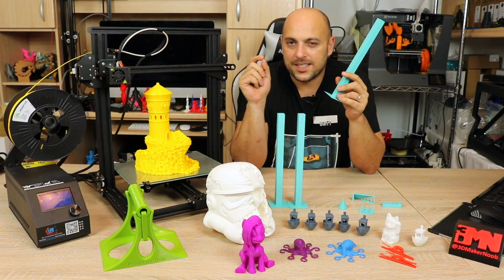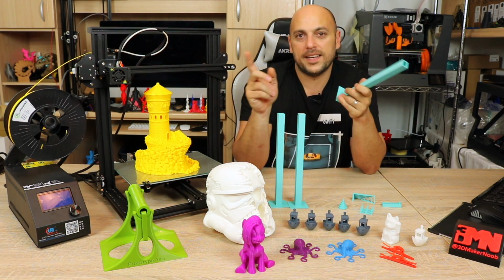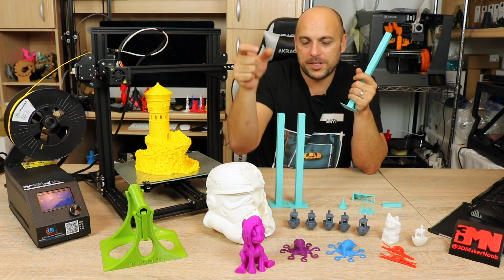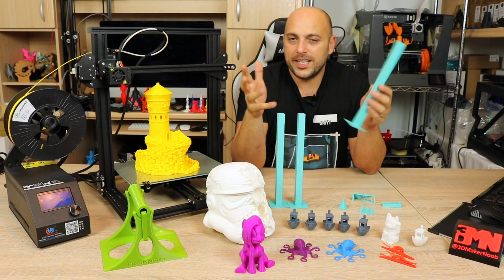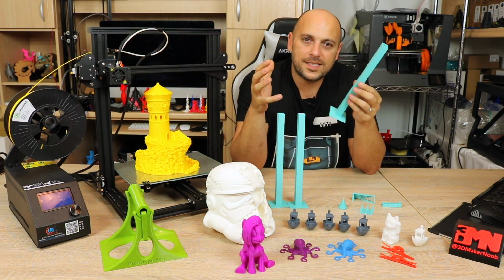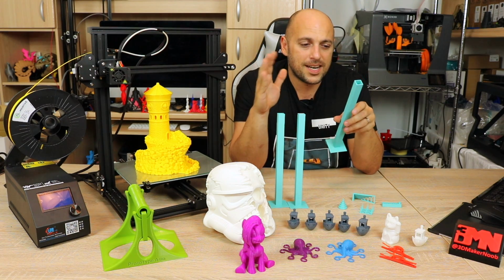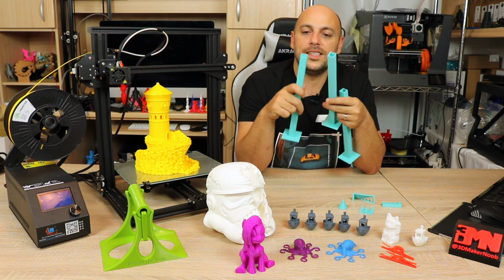It could be the eccentric nuts need to be adjusted, or it could be the fact that now the Z-axis lead screw is kind of held in place, so it might have a role in that. But the Tornado is also the same way. It's still eccentric nuts, it's still a single lead screw, and it is 400 millimeters high. But it printed quite well, so this is something I still need to investigate.